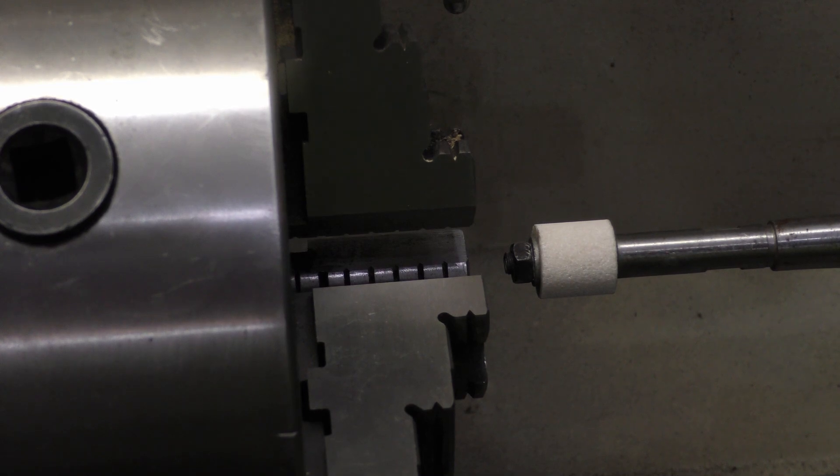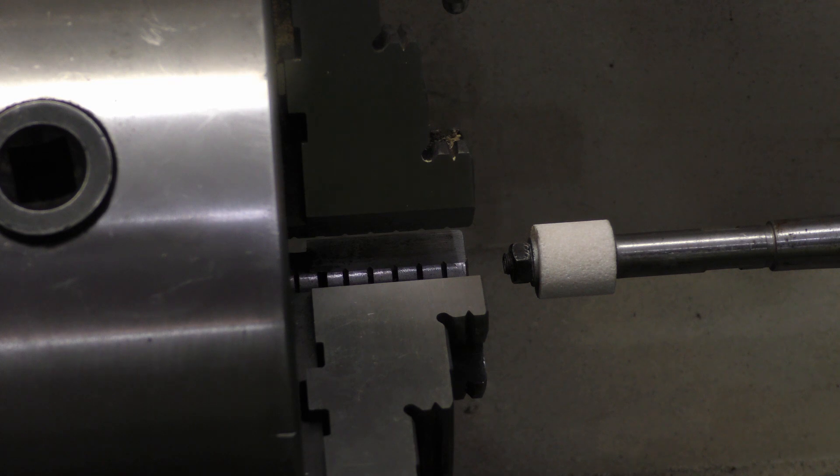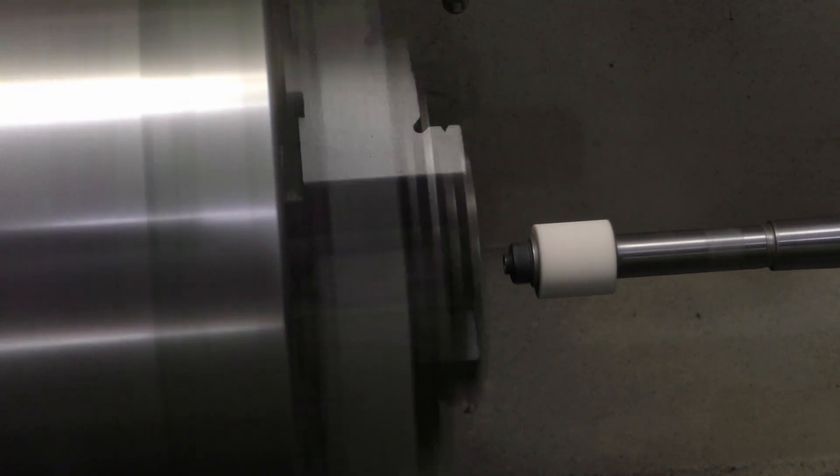Back again. I wanted to get fine control of where the stone is and how much a cut is, so I set my compound rest at about six and a half degrees. It's got a graduation of one thousandths, so each one thousandths on that at that geometry should give me about a tenth of an amount of bite — which may be enough resolution to achieve what I'm trying to do here. We'll first start the spindle at 18,000 RPM, then start the lathe.